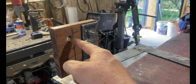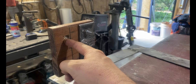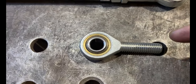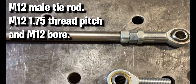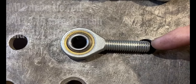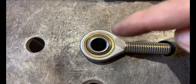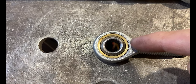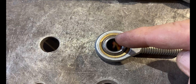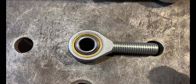Let's talk about our setup for connecting our tie rods to our motor. We are going to use an M12 male tie rod for our push rod connection to our traction loss motor. This is M12 in thread size and M12 in ball size. We need to weld this ball to the casing so it's rigid and we don't get any additional slop in our traction loss push rod connector.